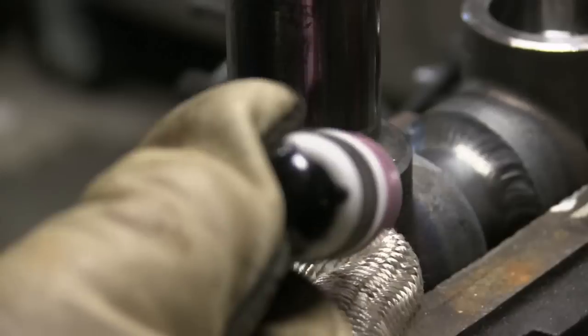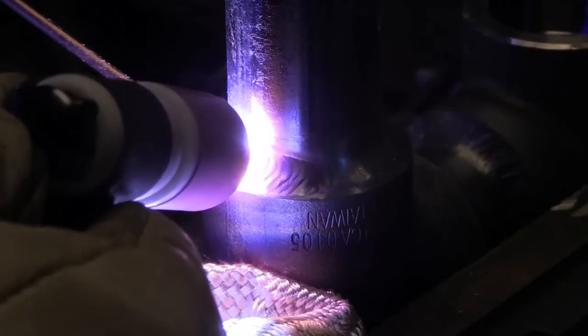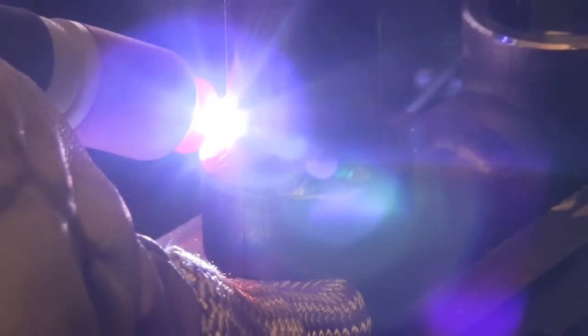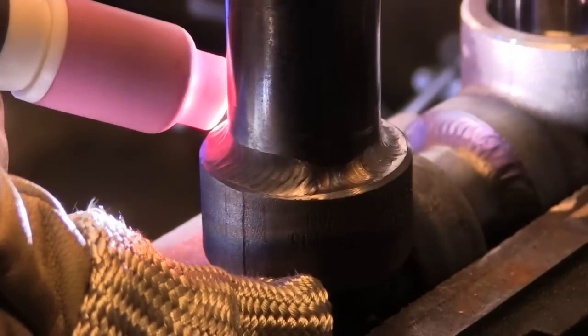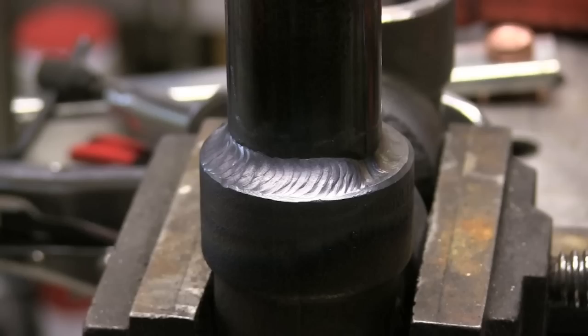Alright, that's one pass. Now the same thing — coming across with the 1/8th, 3.2 millimeter filler wire, trying to mimic the same weave motion that you do walking the cup, just to get some uniformity. It's slightly different because your electrode angle isn't walking back and forth. But sometimes it's absolutely necessary to freehand socket welds — if you're in a tight spot with a bunch of them next to each other, you just can't get the torch to move. You might notice I'm using a full-size gas lens cup here, not a stubby gas lens, because I ordered some from a company and I'm trying them out before putting them on the store. That's part of the second pass, and there's the completed weld.